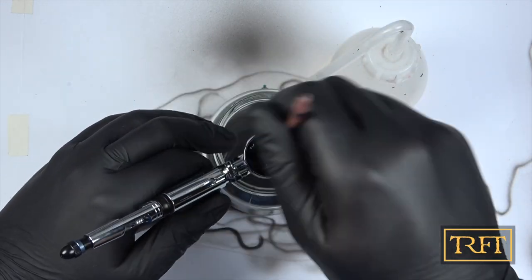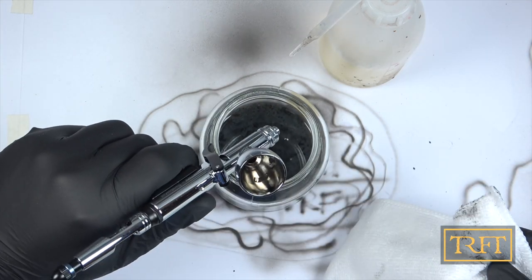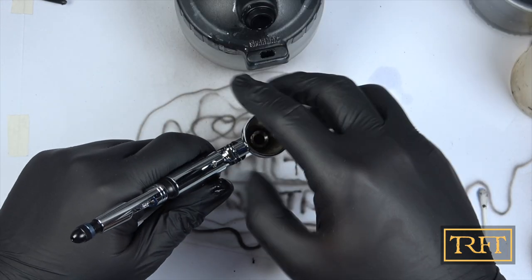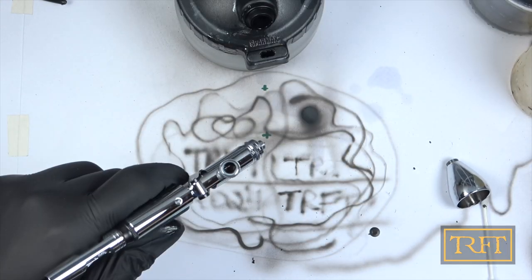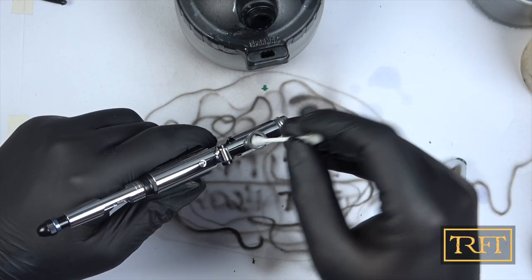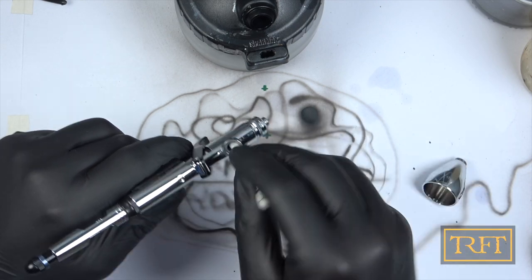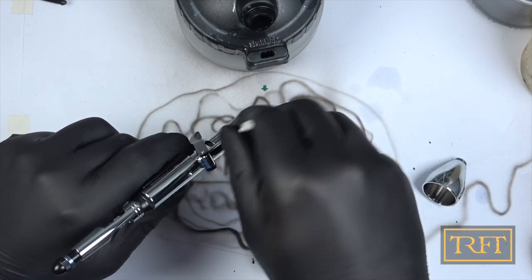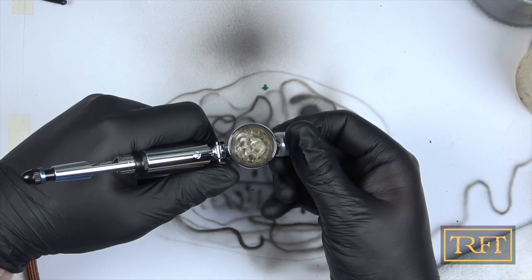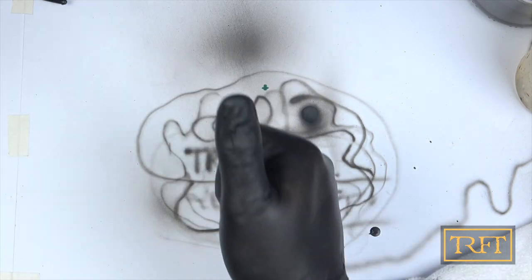Here is where the highly polished paint cup makes a difference. I needed a couple of passes with the cleaning solution, but that is totally normal. Afterwards I removed the cup — another great feature — and got ready for some more cleaning. By the way, those are Teflon seals — you only have that if you spray solvents all the time like I do. After that, it was time to remove the needle, and then for that last back flush. All good.